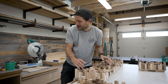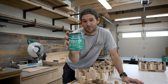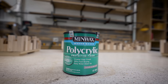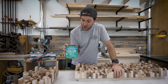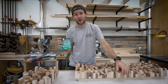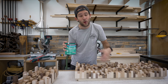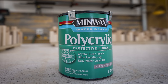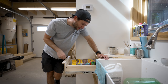Before throwing the finish on, let's put these French cleats on. Now that that's all done, we can finally start applying our finish, which is from the sponsor of today's video — Minwax. Today I'm using their Polycrylic finish, which I've been wanting to try for a while. First, it advertises itself as being extremely fast drying, which means you can get multiple coats on a project much quicker. And second, it's water-based, which makes cleanup at the end of the day much easier.